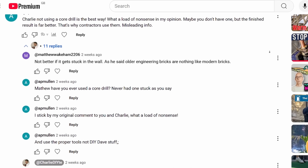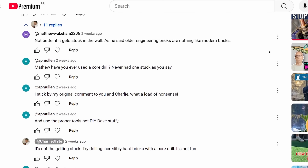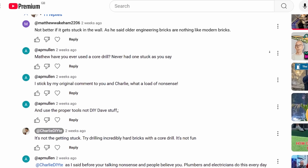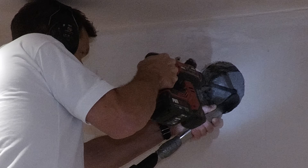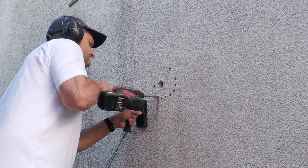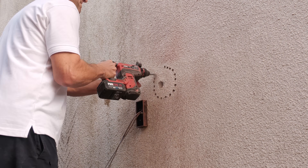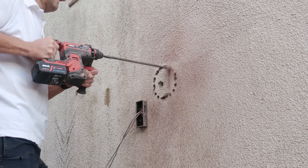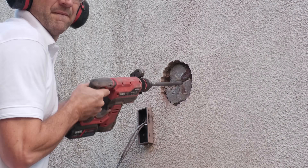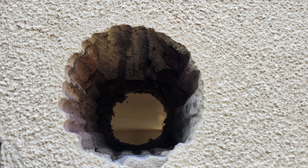Speaking of keyboard warriors, AP Mullen had a proper go at me for not using a core drill bit to drill out the hole for my kitchen oven hood pipework. He said I'm using DIY Dave tools. AP Mullen, don't give me that tool snob stuff — it's not the tools, it's how you use them that's important. Drilling out the hole my way takes about 20 minutes. I've tried attacking these super hard touring bricks with a core drill for previous ducts and I'm not going there again. I built in a gradual two to three degree slope to deflect any condensation outside, and I reckon this is the neatest excavation I've done to date.